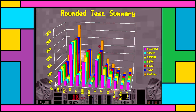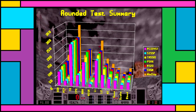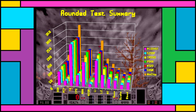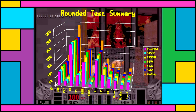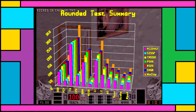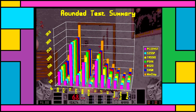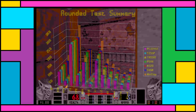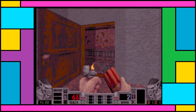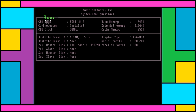I'm going to go back to the Pentium 90 on this motherboard when I'm done here, but it's kind of cool to see how much of a difference the Winchip makes and to make the motherboard do something it almost certainly wasn't ever meant to do. Although this CPU really isn't very good at Quake — it barely breaks 23 frames a second, which we know the P5VX was doing with the P90, and the Winchip doesn't have a very strong floating point unit — otherwise it offers something like a 50% improvement almost everywhere else, if not more. If I'd had a system like this at the time of the Winchip's release, I would certainly have considered installing one. Incidentally, we can also set the FSB to 33MHz — undocumented and not very useful, but that gives us a 50MHz Pentium.